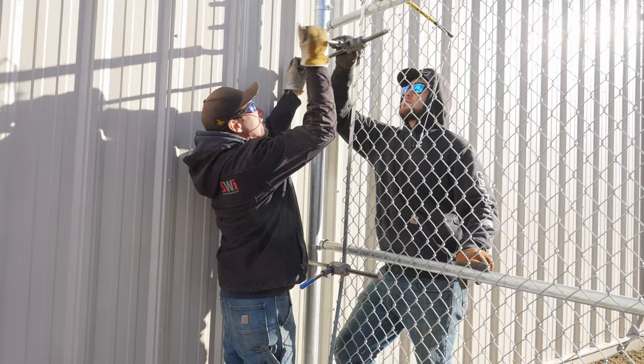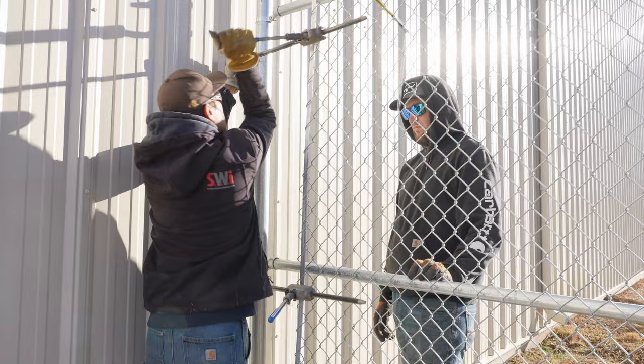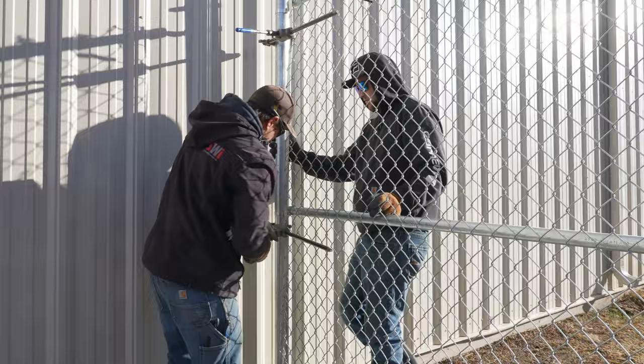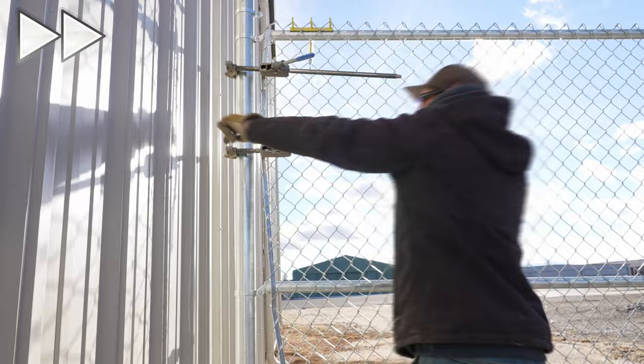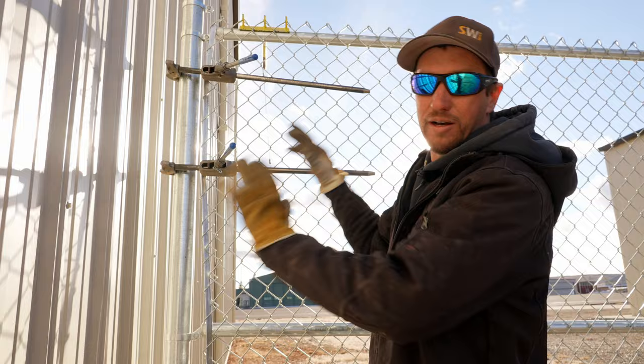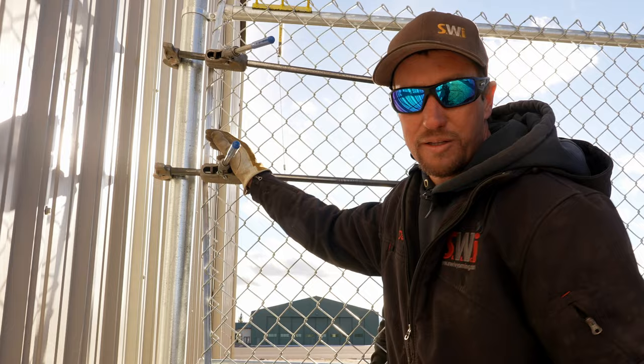Don't turn your back on it. As this one started bringing the chain link closer, this one loosened up because the chain link was sliding over, making it a little bit easier for me to pull on it. I almost put this one in the wrong spot — I had one up here and one down here. They were too far apart for how tight it was getting, so I brought them closer together to help each other out and work better, because I had this one all the way to the post but from here to here there was still a big gap. As I got them closer I was able to eliminate that gap, and I'll just work them down.